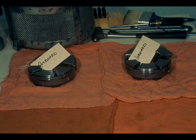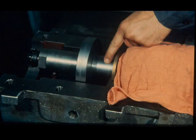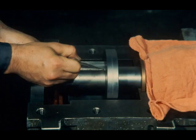All of the parts disassembled thus far are stationary during operation of the equipment in which they are installed. The remainder of the thrust bearing components are attached to the shaft and rotate with it during operation. Before beginning disassembly of the rotating parts, provide yourself with a little insurance which might come in handy during reassembly. Scribe lines on the face of the thrust collar and the lock nut which coincide. This will enable you to tighten the lock nut to exactly the same position during reassembly, and will greatly reduce the possibility of excess run out. Just be sure the line on the thrust collar does not extend to the thrust shoe bearing area.